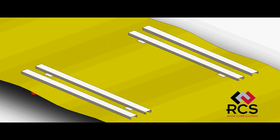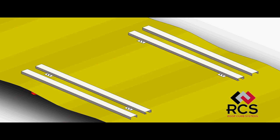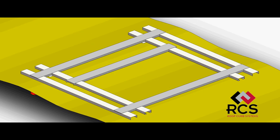Adjacent side channel supports are supplemented for seam-in roof curbs and both are placed parallel to the track rail, so their position is offset to support the panel curb connection. The two longer cross-channel members are factory notched to the width of the curb flanges and are placed at the downslope flange and the upslope flange to be used as backer plates for fasteners at the curb panel lap. The shorter factory notched cross-channel is to be placed under the diverter or within the curb opening, depending on equipment clearances to terminate the insulation.